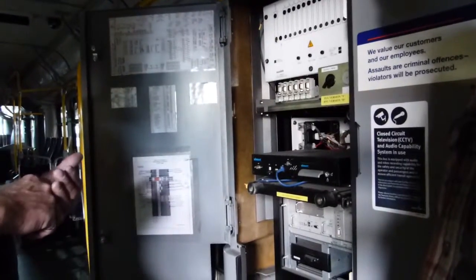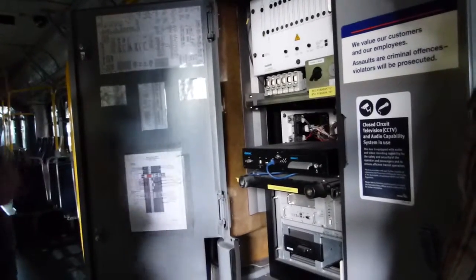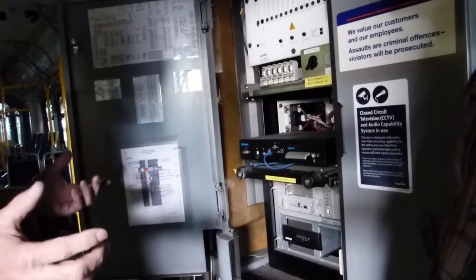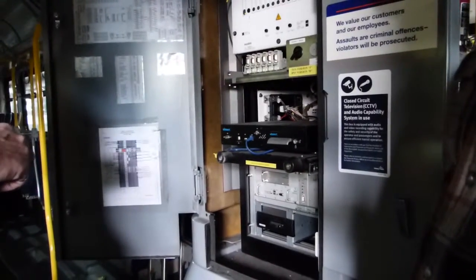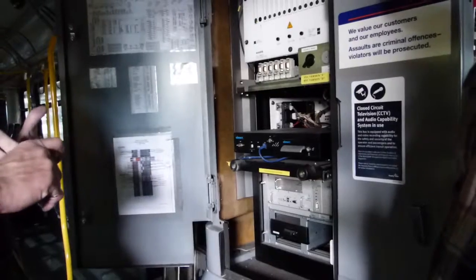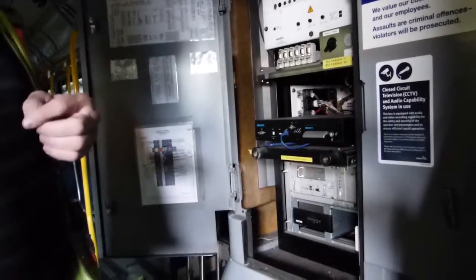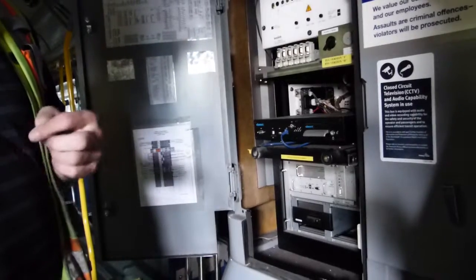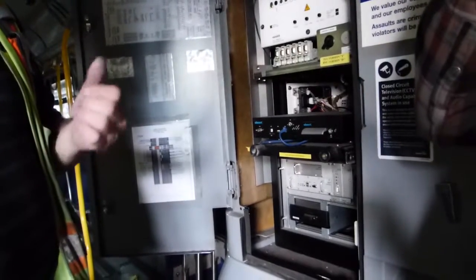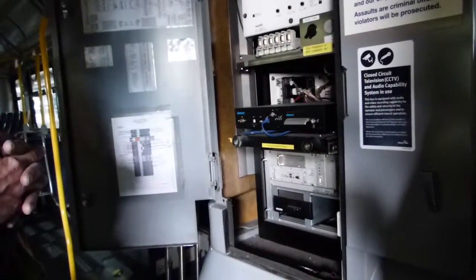You can double-check things by manually switching and see lights go on and off at the IGBT driver board, for example. If there is nothing obviously blown up, we're going to make additional measurements. We have fiber optics — it's going to be phased out, but right now all these buses have fiber optics just for the propulsion side, for noise immunity and additional insulation. But the problem is fiber optics, as we were told from Germany, is they're starting to wear out. The LEDs are degrading. From what used to be 120 microwatts, which is nice and bright, we see as low as 20 microwatts only.